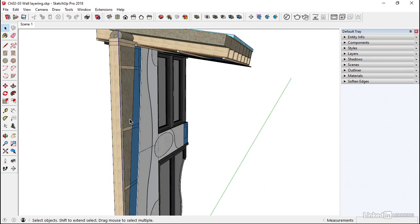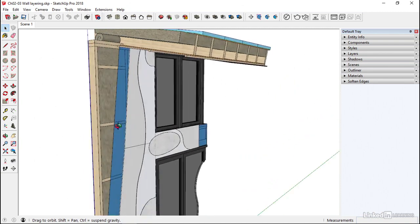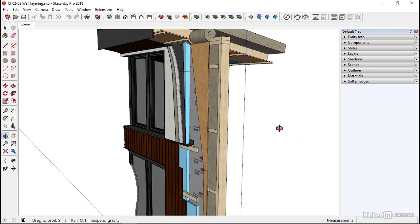If we do get moisture through the vapor barrier, and it can easily get through openings for switches and other lighting fixtures or anything else that's going in the wall, so we've got to be careful. If we do get moisture behind there and we don't have things like inert mineral wool, then potentially that can start to rot or mold can build up on the insulation inside. And as soon as you get damp insulation, then it becomes much less efficient. Okay, so this is the sort of thing you need to consider.